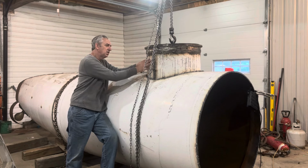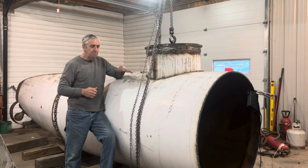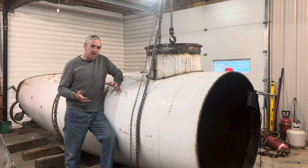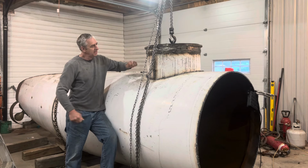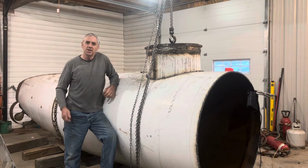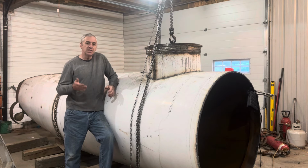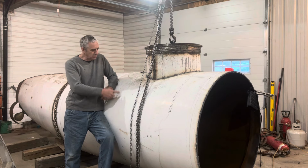You're better off to build this piece, then cut the hole, fit it to sink in, then the rings go in. It all has to be done in the right order, because we can't get the rings in and true up the hull if this is in. So the next step, put in those rings. I don't have to put in the T section of the ring, just the heavy 5/8 rib that goes inside.